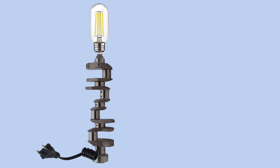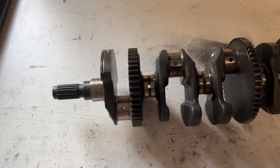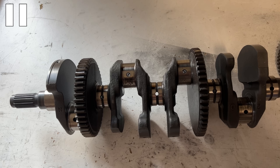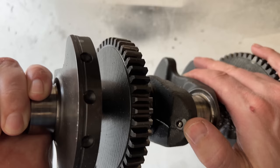The correct thing to do is run the wire through the center of the crankshaft. But of course there is no solid center of a crankshaft — the journals are offset by definition, otherwise it wouldn't be a crankshaft. Part of this problem is solved for us by the good people at Honda. You need to get oil to the connecting rods, and the way they do this is by drilling a passage through the crankshaft from the main bearings to the connecting rod bearings. The main bearings get oil from the oil pump, and that oil is pushed through the hole drilled in the crankshaft to where the connecting rod is connected.